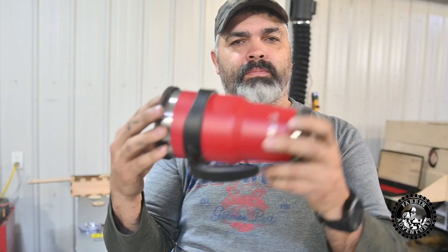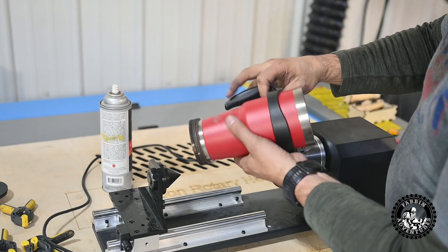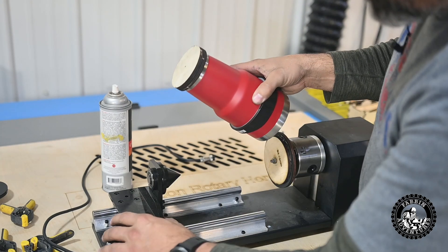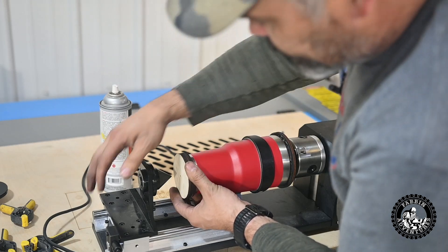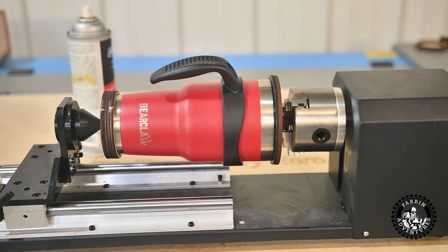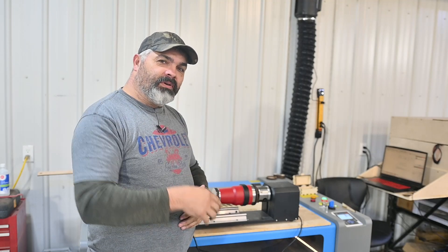That fits perfectly — just a slight little bit of wiggle room. It's as simple as putting the mug in there and tightening it down. One important note: you don't want your backing disc bigger than your tumbler, because if your laser has to travel close to the end it could hit the backing disc. My laser is focused at 15 millimeters above, so you definitely don't want more than 15 millimeters of the disc sticking up above the tumbler. Put the tumbler in, put the rear cup on, pull it into center, and there it is. I hope this disc setup helps you out. If you find value in these videos, make sure you subscribe, share, like, give me a thumbs up, and we'll catch you on the next episode.